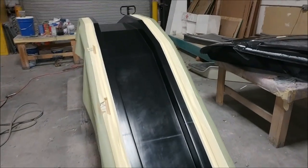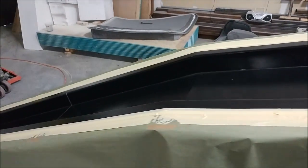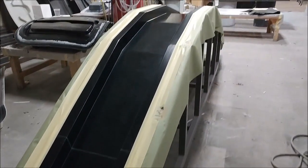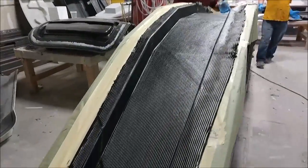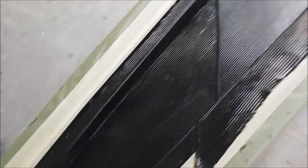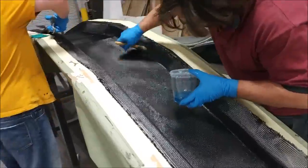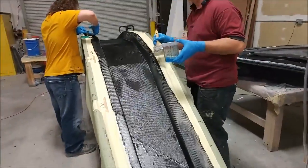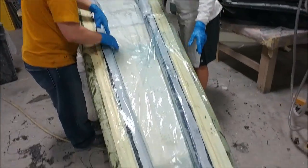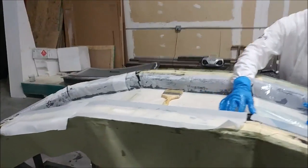It's finally time to lay up the main spar. The mold is all prepped with marks for different layout positions. Jeff got the first set of plies down, and there's a lot of work to do — you lay up the plies, then there's core in the middle, then tape plies that make up the top and bottom caps. It's a whole day job, then it was bagged, and the next day Jeff took the bag off and closed out the plies on the inside. It's a two-day job with the current manpower.